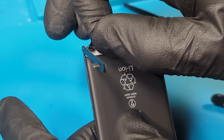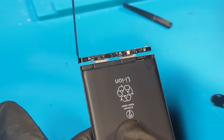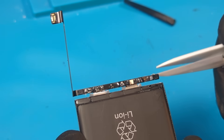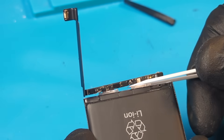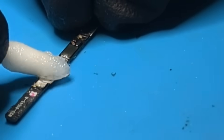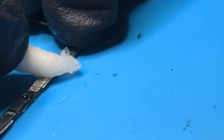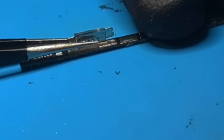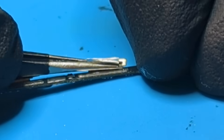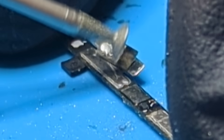Finally, we are at the fun part where we get to disassemble the battery. There's not that much holding the battery together, just some tape and some protective shields. We use a pair of ceramic scissors here to remove the BMS from the battery cell. Cleaning the BMS requires a good rub with some alcohol. Now it's time to remove the remaining nickel and aluminium that's been left on the BMS.